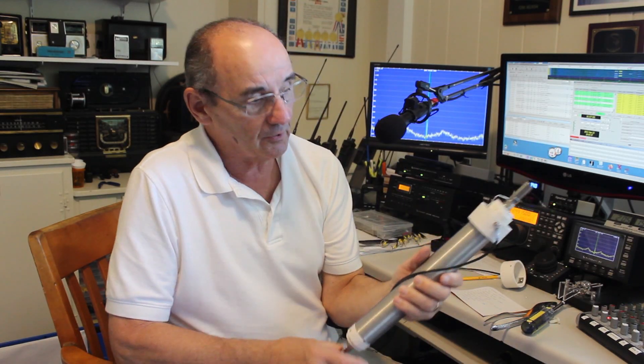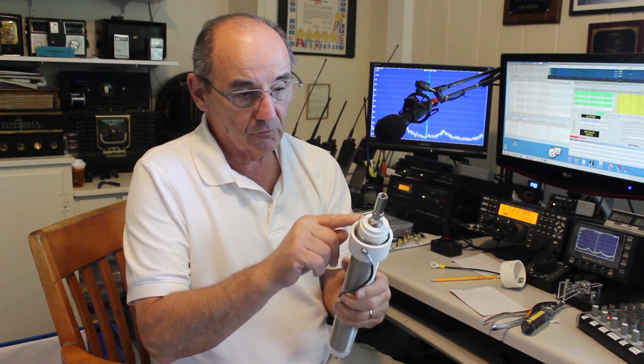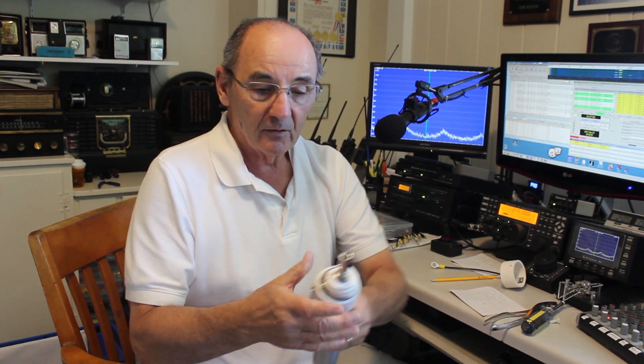A common question: I can't get my Silver Bullet 1000 or my Mini to tune. The way this is constructed, the current goes from the base into the mount, to the collar out the top. So if I pull this collar off the whole item and put a continuity tester from one end to the other, I get nothing — there's no continuity. Once I put the collar on, I get continuity. So if there's continuity from here to here, the coil's working fine. 95% of all the complaints we get that they can't tune come down to two different things. First, it's a coax issue — I've had people use two pieces of coax and still have issues until they put a third good one on.